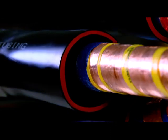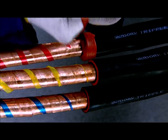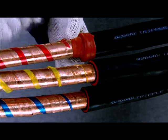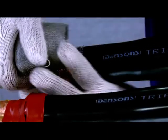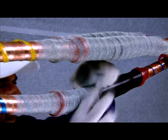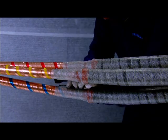Place all the stress control tubings in the right position and shrink them from the center towards the sides with the help of blow lamp or blow torch. The tubing should be fully shrunk and wrinkle free. Remove the release paper from the red mastic tape and wrap one layer around the end of the tubings to seal it completely. Wrap two layers of copper woven flexible mesh with 50% overlap around the joint area, continuing for 20 mm over the shield on both sides. Fix the copper mesh tape on metallic shielding with the help of solder and flux.